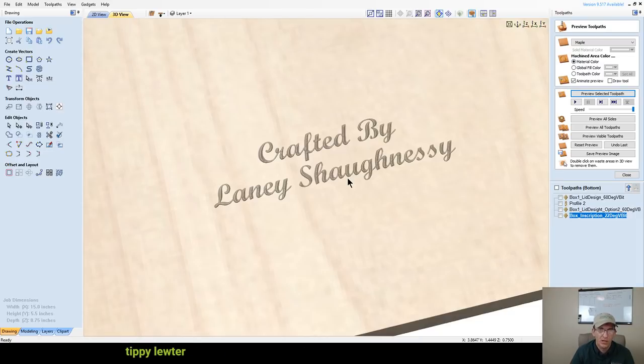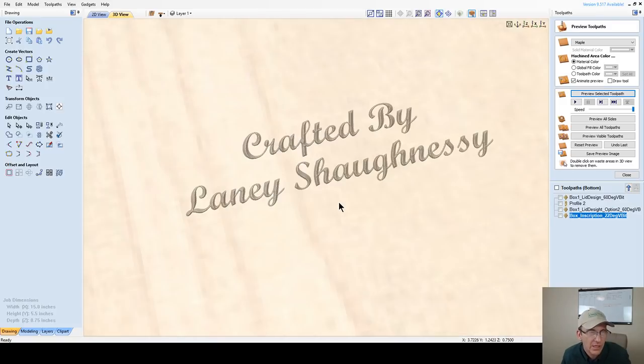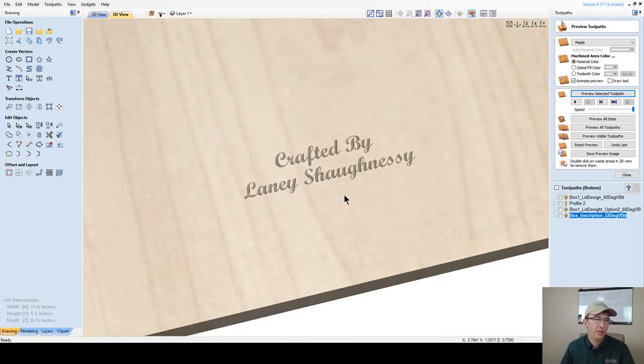And imagine if I got even smaller than this, if I was using a 60, I'm at 30 thousandths. 30 thousandths is not much. It's a 32nd basically, 0.03125. So it's not a whole lot there. With my 60 degree V-bit, I'd get more definition out of the 22. So it all depends on what you're looking for. But those four bits, 22, 60, 90, and 120 degree V-bit, would all be good bits to utilize.